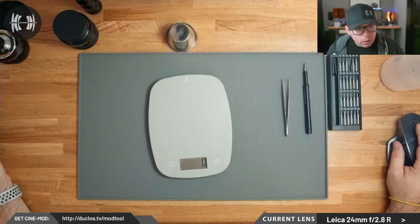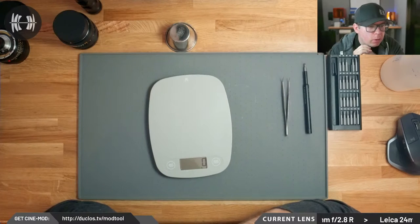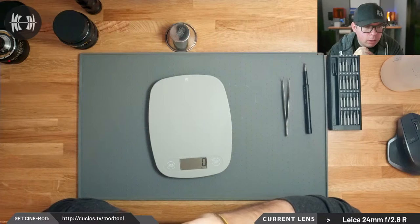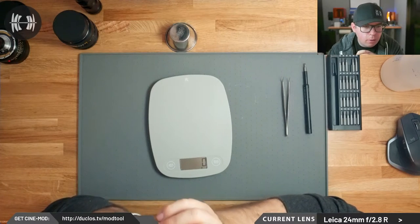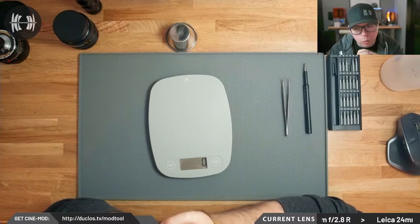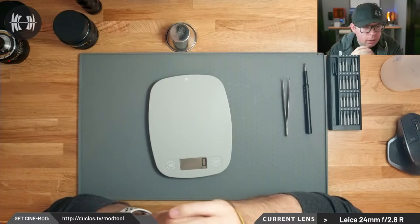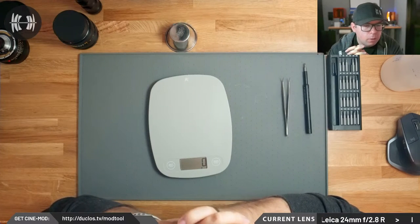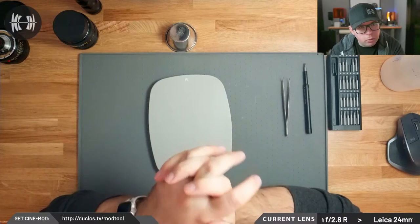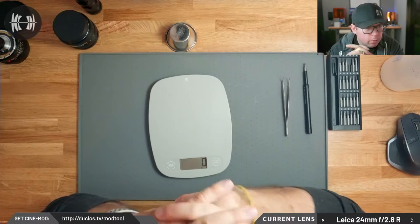Matthew, I tested some Leica R in a local rental house and the lenses were de-clicked, but the aperture was slowly closing by itself. What is causing that problem? Wrong lube. No, not the wrong lube. It has nothing to do with the lube. It has to do with how the lens was declicked. So ask that rental house where they got the work done, and then ask them to send it back to be adjusted. It's inevitable. The aperture will loosen up over time, but depending on how it was declicked, that can be mitigated or can be prevented for much longer periods of time.